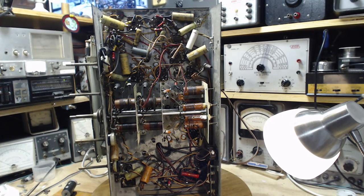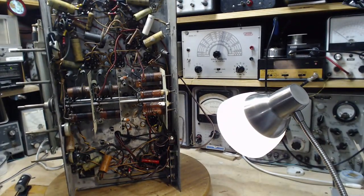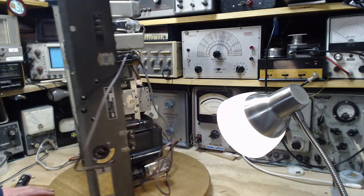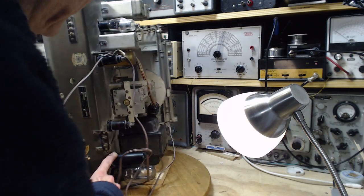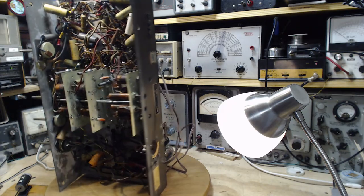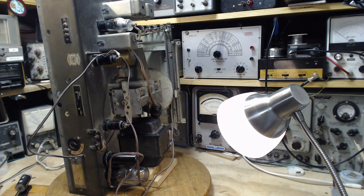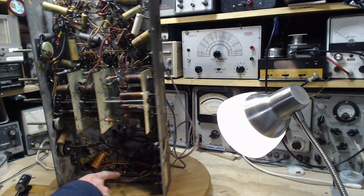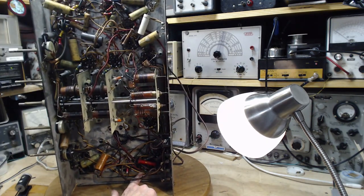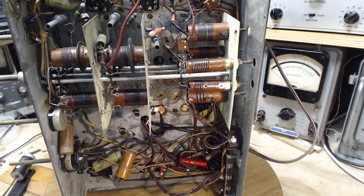And then I probably can, I'm going to have to really look into this, plug the speaker that's in the other Westinghouse radio, just take it out of there and plug it right into this one. You know what, I can't do that because this isn't push-pull. I don't think it's push-pull. A 6L6, yeah, I don't think it's push-pull. So that might make things a little easier. That means there should only be 4 wires going to the speaker. So there's the speaker thing, right down here. This is the speaker thing? Yeah. Right down there. What do we get out of that?